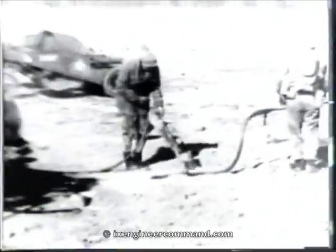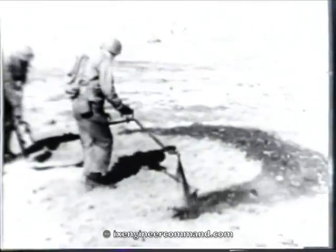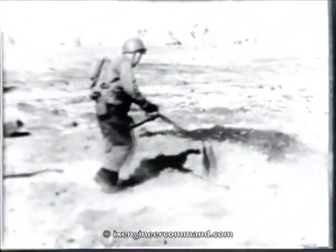This is an asphalt repair unit weighing 1,100 pounds empty. Its capacity is 110 gallons and is equipped with a motor-driven spray. Its heating system can burn kerosene or gasoline. The asphalt, RC2, is applied in three coats of about one-half gallon per square yard each coat. The temperature of the asphalt, when applied, should be 120 degrees Fahrenheit.